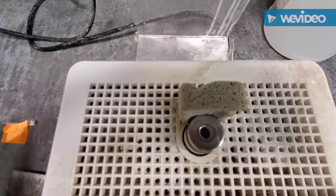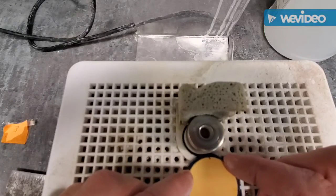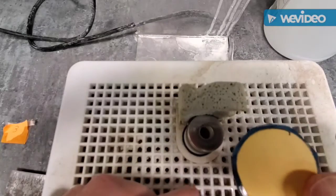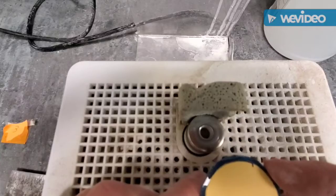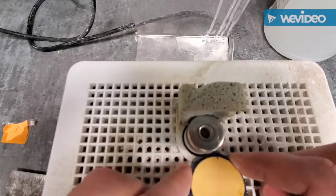Don't just push it in one spot, because if you just push it in one spot, you'll just have a dent in there. So I'm just grinding this along the edge, keeping it really flat. Here's another one I'm going to be grinding — I just kind of keep turning it and grind it down. This has quite a bit to grind, so it's really in your best interest to clip some of that off before so you have less grinding to do.